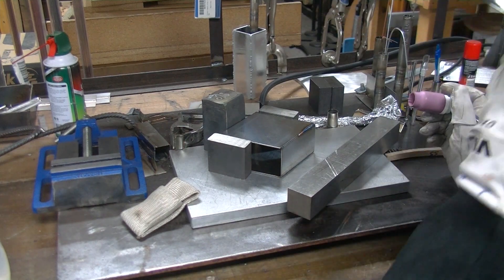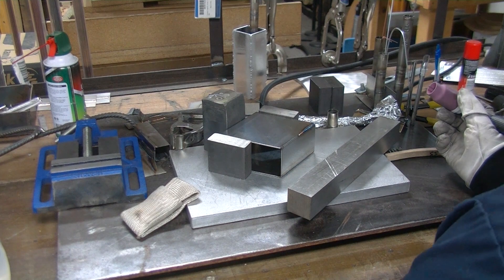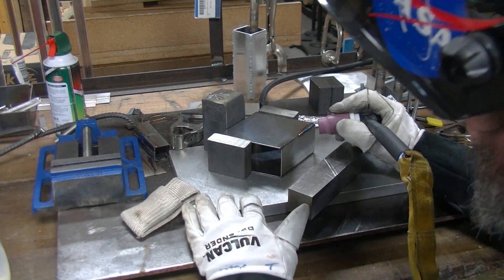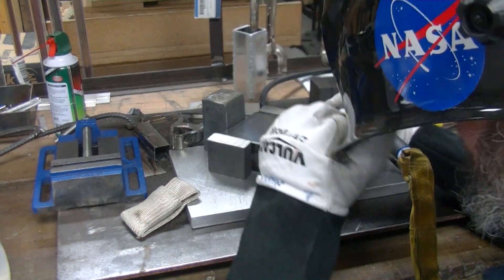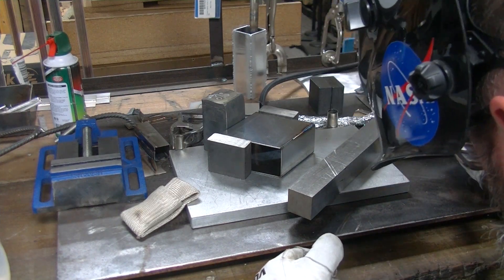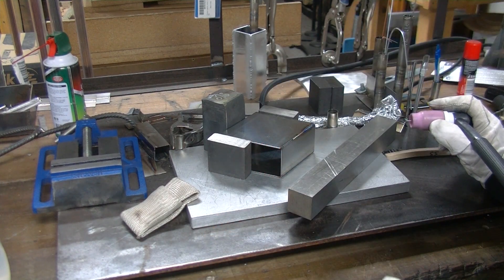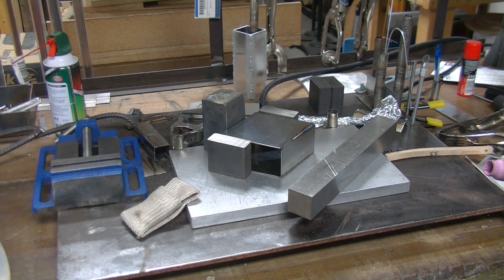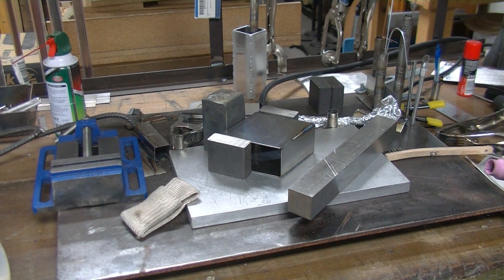We were at 45, now I'm at 38. I'm trying — as you can see I've stuck it a couple of times — I'm trying to keep this really close. What I'm trying to do is to get as colorless a weld as I can. We're in like 34 to 35 now, and with this pulse setting when I initiate the arc I am hammered down. It looks like my pulse duty is around 20-something percent.